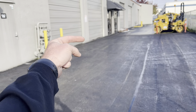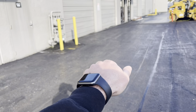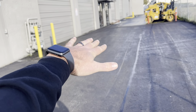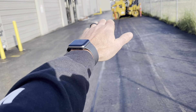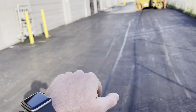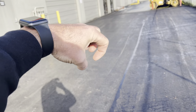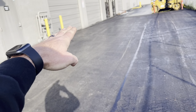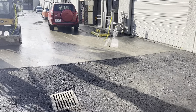Basically how we ended up doing this: we pulled out all the asphalt first, then I took the farthest garage door and we sloped in with the mini — just sloped in naturally, tying into what was there, and tried to make it slope down away all the way to the flow line. That got us to our height, and then we had to chase that height back this way, dragging our flow line cut, and came back into the middle and connected the dots, removing whatever had to be removed.